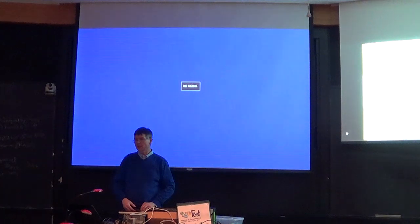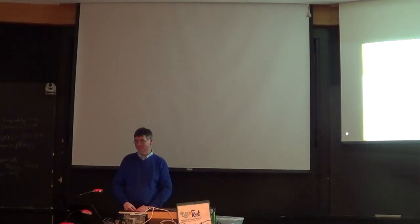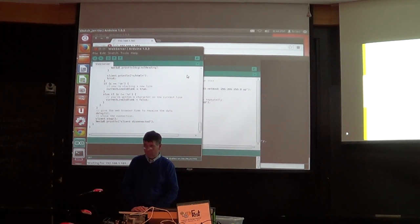Yes. So that might be an exercise for a homework assignment. You can even do simple things like there's a tool called Flash Hybrid that uses some of your memory to store files that are frequently updated, like the whole var file system. It eats up a little bit of RAM, but saves your flash from getting hammered on. And for your home directory and other stuff, you can mount other rotating disks. So you could mix and match all these things.